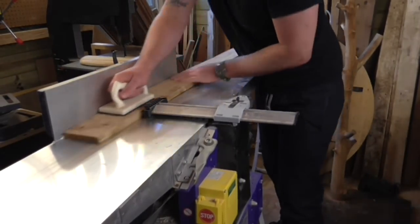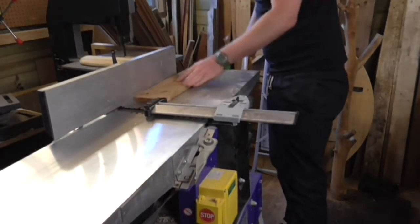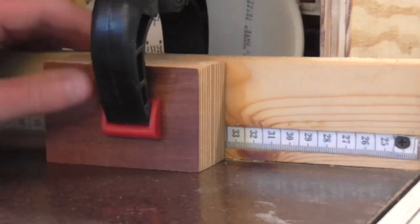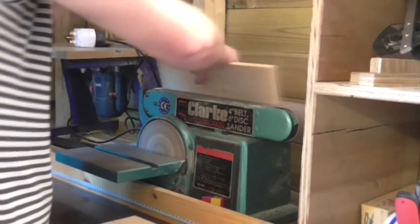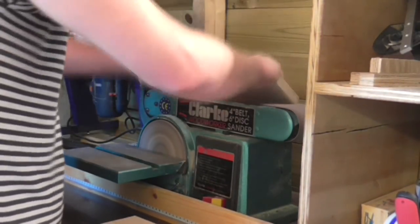I wanted to make a little enclosure at the bottom of the cat tree. I planed down some pallet wood on the jointer and then set up a stop block at the miter station to cut some slats to about 34cm, which would be the height of the enclosure. I chopped several pieces to this length and then rounded the edges of each piece on the belt sander. The pallet wood was full of knocks, bumps, and nail holes, and I wanted to retain all of that rustic character — I thought rounding the edges would give it a nice worn-in look.